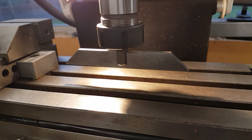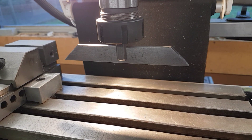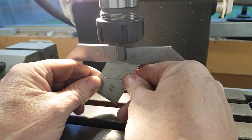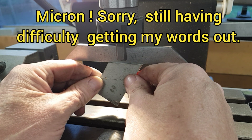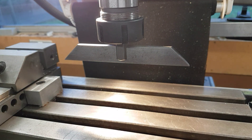This will need Loctite, left to set, and then drilled and pinned. But the advantage with this once it's all finished — I drop the table down a little. If I wanted to set, say, this 60-degree plate and wanted to machine it, I'd normally have to tram it. Now all I need to do is set it to the underside of there and it's near as damn it. It's not going to be micro-accurate — we're not talking tenths or anything like that. This is just if you want to set something up quick and take a parallel skim. Once it's all together — glued, screwed, bolted — I'll do a little demo and indicate after to show how accurate it is.